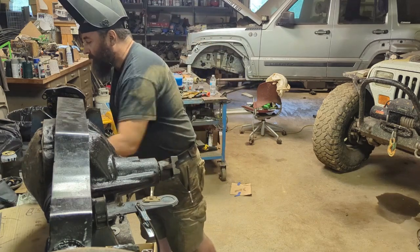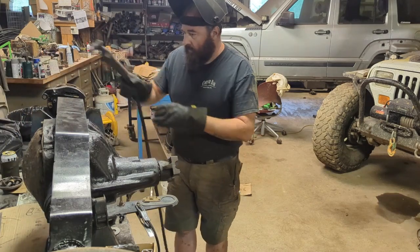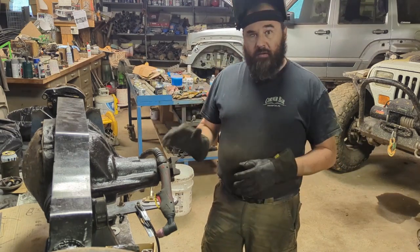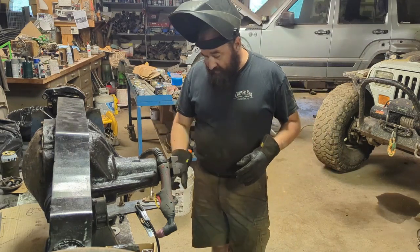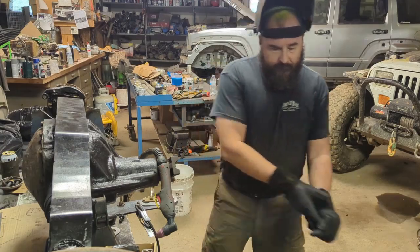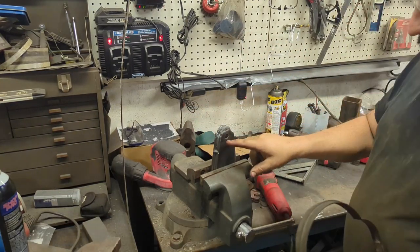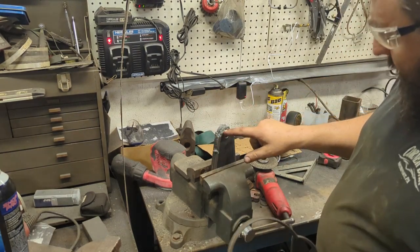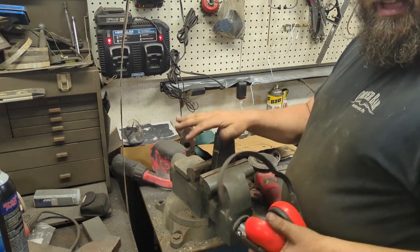A really clean piece. So that's that, guys - I don't know how long that was, 20 minutes again maybe. I made four really nice clean brackets. The one I screwed up I may have to remake, but I love owning a plasma cutter, and these 911 Motorsports templates make it really easy to make actually clean, nice-looking pieces. We've got all of our shock tabs burnt out. I went ahead and welded them together so I could drill the holes so I know they're all in the exact same spot. Now we're going to start cleaning this thing up and shaping it a little bit. I'll weld some more to the one that's cut funky and get these all as close as I can before we go any further.